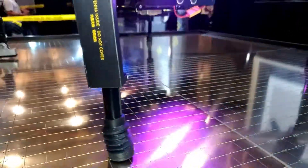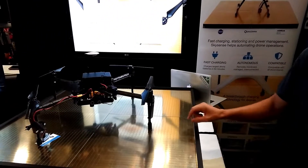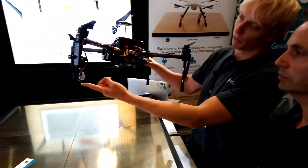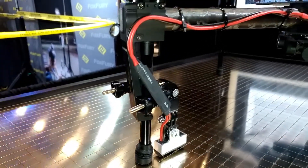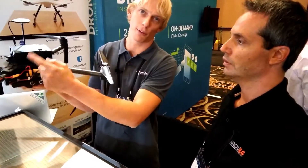Sure. So we are at SkySense and we're building a charging infrastructure component for the drone economy. What you see here is a charging station that is compatible with mostly any drone nowadays on the market. It's made of a conductive platform made of many isolated tiles that can be dynamically activated. On the drone itself, there is one plugin that must be installed. In this case, the weight is 40 grams. It's basically made of two spring-loaded contacts, one tech circuit, and a wire that goes straight into the power distribution board of the drone — charge of BMS or PCM.